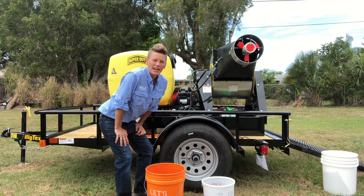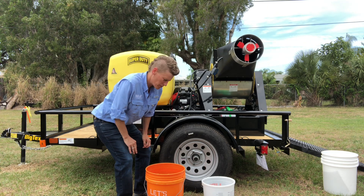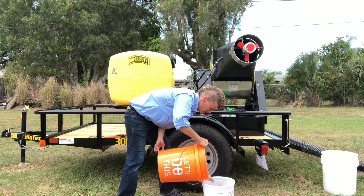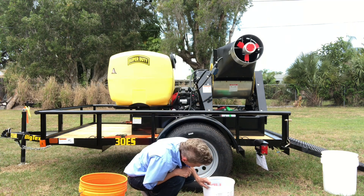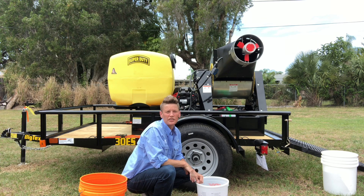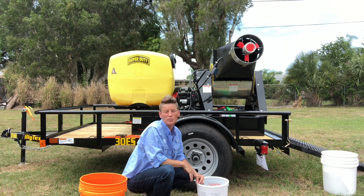After the one-minute run, take all the material in the bucket, pour it into the graduated bucket, and measure the actual output to ensure that we have 1.5 gallons per minute — and indeed, we have 1.5 gallons per minute. I normally do this process three times to ensure accuracy. If I need to make adjustments, I do that, and then try to achieve the same measurement three times. And that is the basics of how you calibrate flow on the A1 Super Duty.